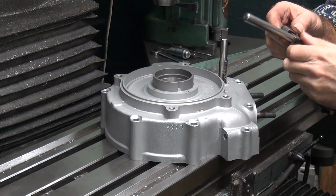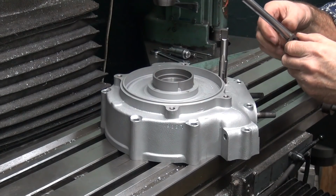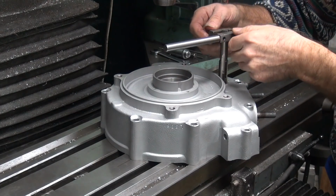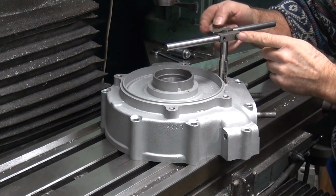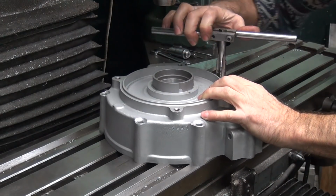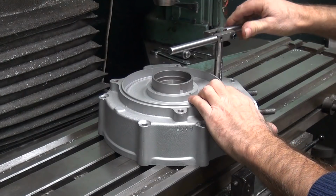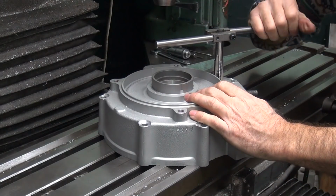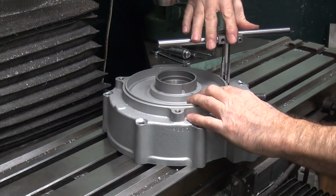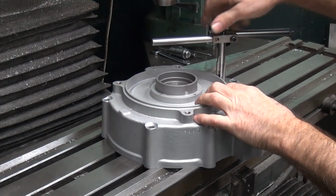This appears to be the wrong size tap drill. Tap holder. But we're going to make it work. See, that's why you put long Allens in it, so you can go further apart. You want to make sure you don't angle it one way to tilt it. If you go in the center, it'll go straight down.